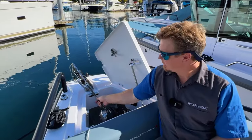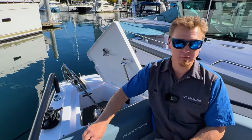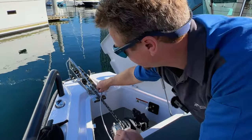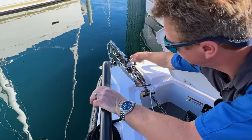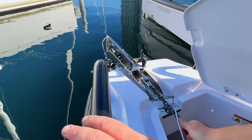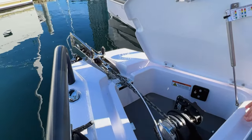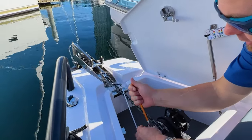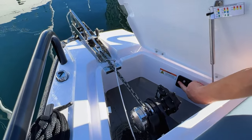Everything is back up and I'm going to re-secure it. After every anchoring event you need to put the safety equipment back where it was. The safety lanyard goes back in, and then the anti-rattle device — it only spins one way correctly. Work yourself backwards and forwards until both sides are nice and tight, so you can feel it's in a secure spot. We've got two layers of security should the anchor ever randomly release.